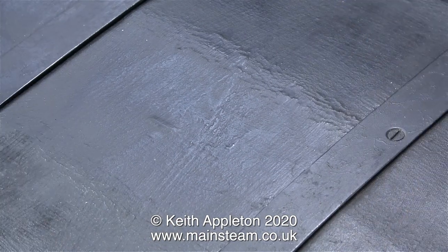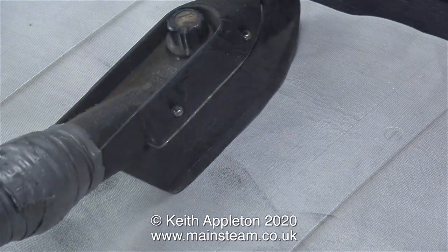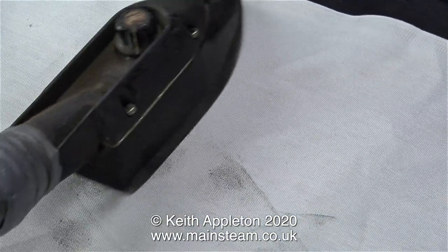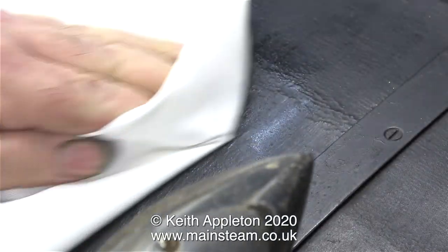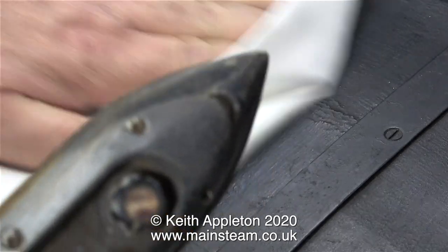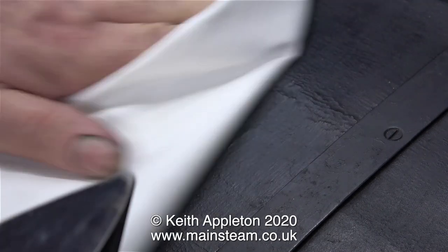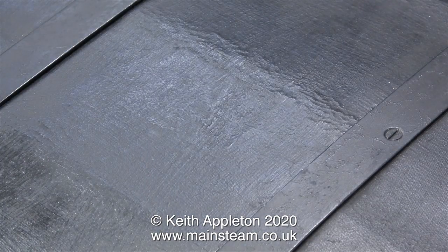You have to be very careful with these special irons — it depends on the temperature you need. Here's a word of caution: do not apply these irons directly to the paintwork. If you do that, you will thoroughly spoil the job and get a lot of extra bubbles as the paint blisters. In common with a lot of jobs I do in the workshop, it's a feel thing — knowing when to withdraw the heat. After withdrawing the heat, it's very important to make sure that the fabric sticks to the wood underneath, achieved by rubbing the cloth, which is still warm, over the surface.